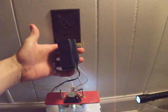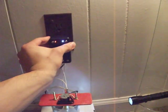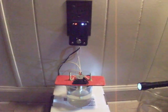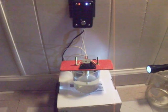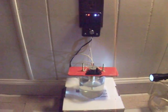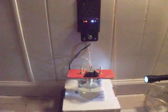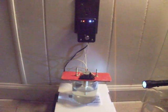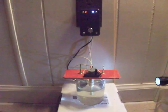The supply itself plugs right into the wall. It's kind of an unholy combination of a wall adapter and a project box. Inside of it is a cascade multiplier. I just have the rotary switch on the highest current or highest voltage ranges attached to each stage of the cascade. The current ranges are limited by capacitors that are in series with the incoming AC from the wall adapter. The design is simple, it's consistent, practically EMP proof, and overall it works great. Just figured I'd share it with you guys and let you design your own.